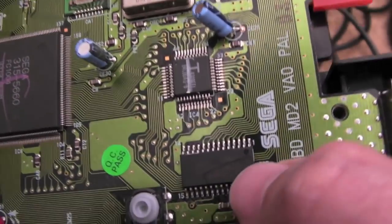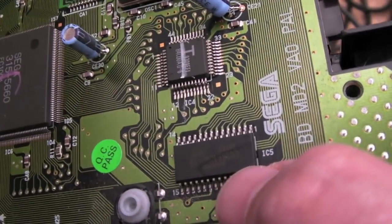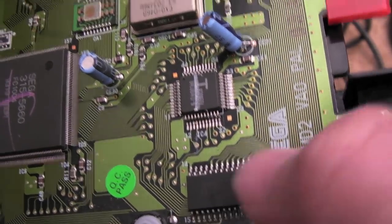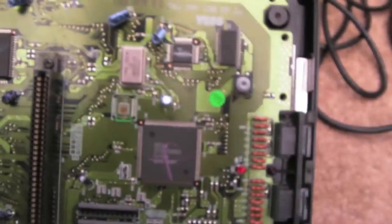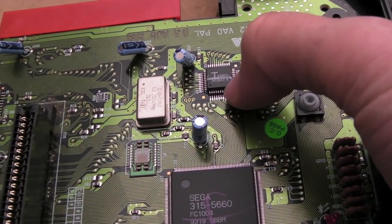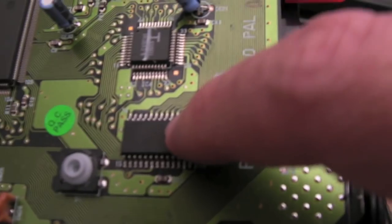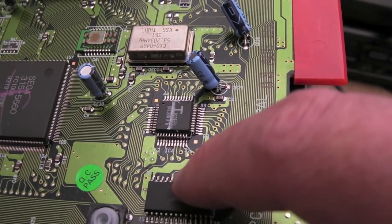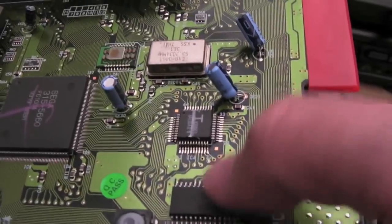Yeah, I'll try and zoom in on that in a minute, but I'm guessing that's perhaps another RAM. Yeah, it looks like it is. Sanyo, yeah, that's another RAM. It's got -10. Oh, that could be the Z80, is it? Yeah, that's the Z80. Sorry, you can't quite see this. Ignore what we're saying. The Z80 is not merged with this. That's the Z80. It's again the PLCC version. It says 84C00, I think it is. Yeah, that's it. That's your sound RAM, because you can see the connections coming up here to the Z80 there, so that's your sound RAM.